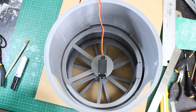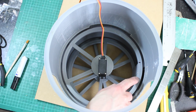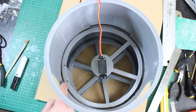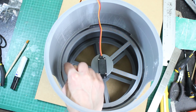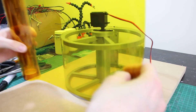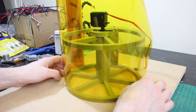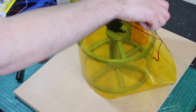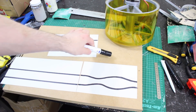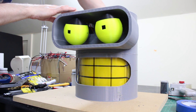This is fixed to the mouth and the inside turns against it. Even though this isn't a 360 servo and only does about 190 degrees, we actually get most of a 360 for the inner carousel showing through the window. This mark is currently aligned with the edge of the window on this side — if I rotate all the way around, the other mark shows at this side. So this window is quite wide, which means we get almost the whole carousel shown through the window — almost a 360 — so we need a complete wraparound for the inner mouth. I've got acetate on here which is completely clear, then yellow lighting gel — actually used for putting in front of lights for clubs and stage shows. It's completely clear though, so we're going to need another layer of diffuser — we don't want to see straight inside. To make the light diffuse from the inside, we're going to use normal white paper. Some of that inside should work pretty well. I've drawn the mouth patterns on the paper so I can sandwich the paper between the acetate and the lighting gel, and I can just swap the paper if I ever want to change the mouth expressions.